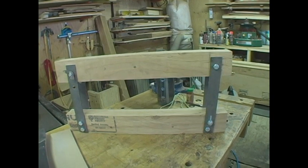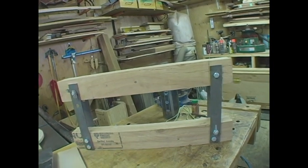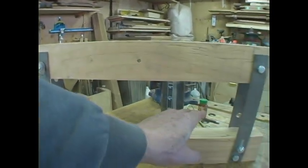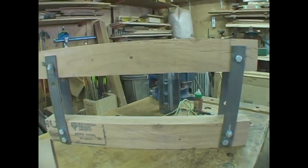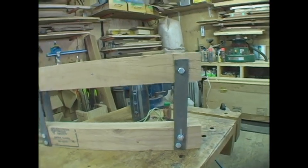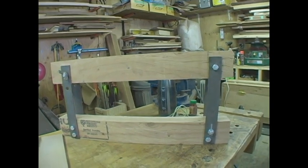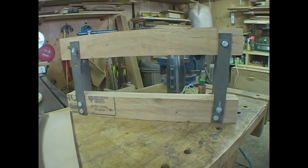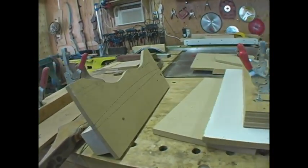Last but not least is something very simple — just two pieces of laminated plywood and some steel straps. I glue a riser together, place the riser in here, put fire hose in, pump it up to 80 pounds per square inch, and it's clamped. You don't get all the slip and slide you do with other methods like C-clamps. We'll be doing a segment on each of these, and we're going to build a couple of them to give you a notion on how it's done — then you can be as creative as you want.